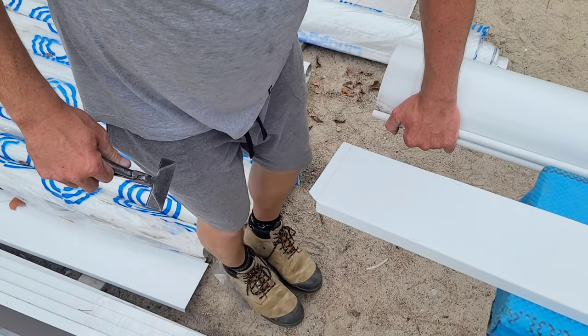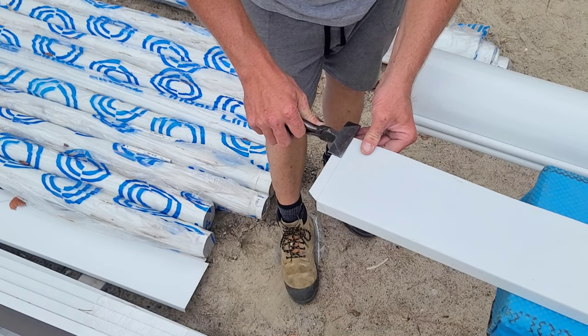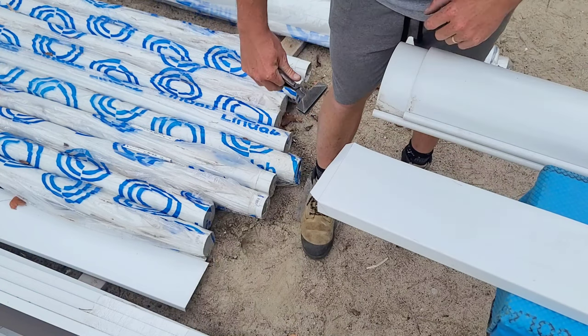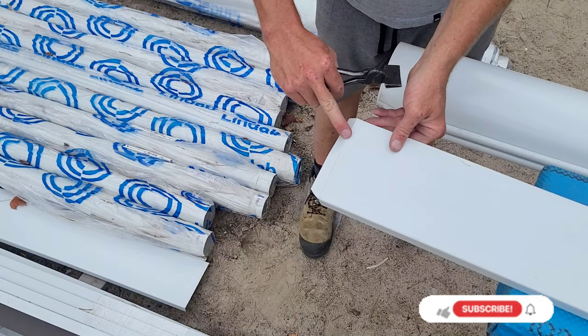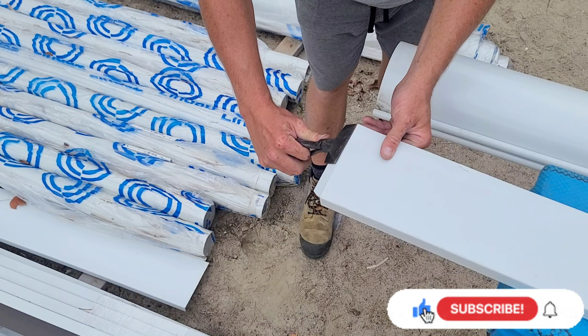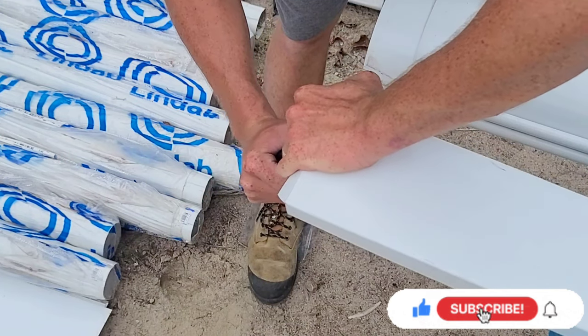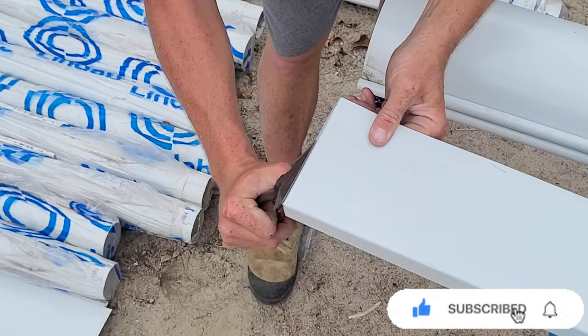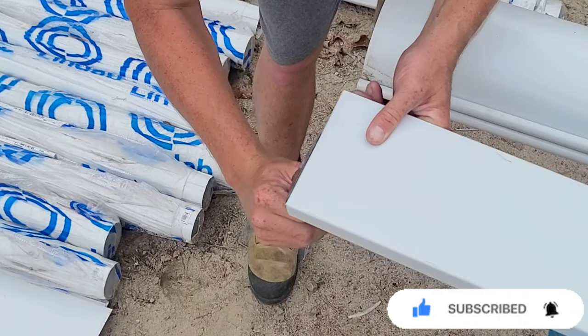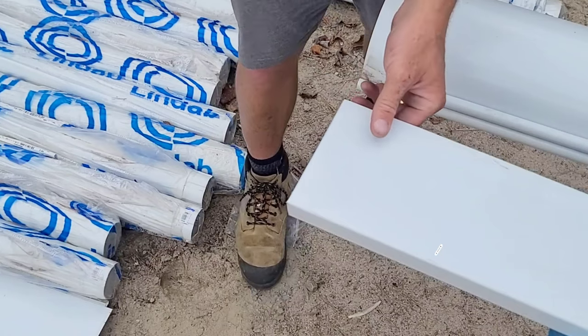I have my folders — just some one-inch deep folders. I'm going to brace it with my hand and kink it to start. Give that little kink there and then finish the bend to 90 degrees. This will give good support for when we finish the fascia board later on.